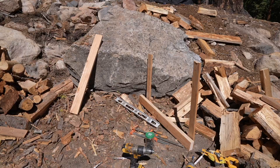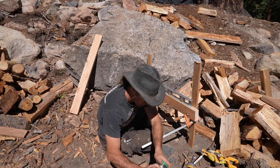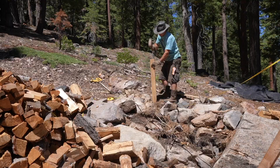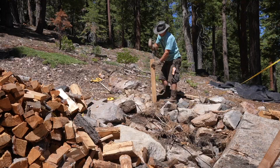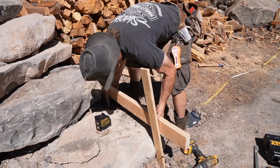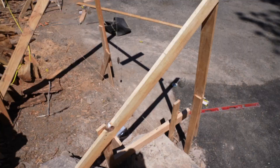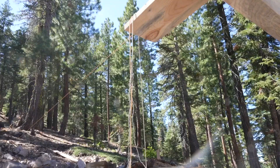While I waited for the wood to dry I did my foundation layout. I struggled quite a bit figuring out my post locations. I watched several videos on YouTube and learned a lot of basic tips on how to use string for layout. However my specific location gave me some difficulties. Having the back beam high up on the hillside meant I had to figure out some clever way to align my front posts because they were not in the same horizontal plane. The pavement was in the way of where I needed to put some layout stakes and I had to offset some locations using multiple batter boards. Eventually I came to the conclusion that I had to do a virtual layout high up on my front post locations in order to get everything to line up.